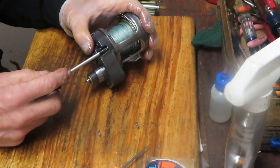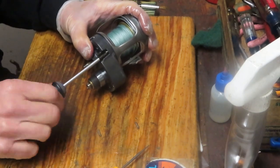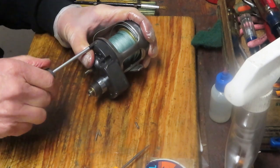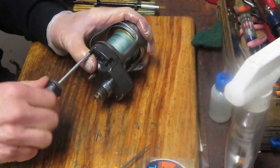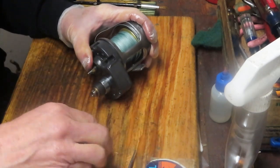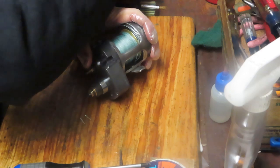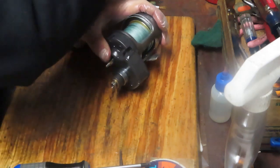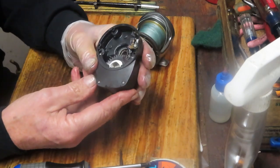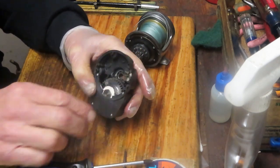The first two screws are the same. Moving to the other side, we'll see if we need to pull that last screw holding the back bezel on — sometimes I pull them and don't need to, sometimes I don't pull them and I do. These four screws are all the same thread and size, so it won't matter where you reinstall them. With that done, we should be able to push through the gear stack. We'll have to remove this to service the gear stack.